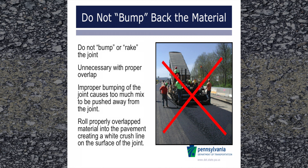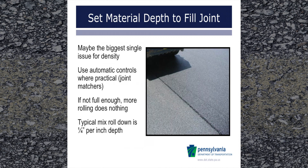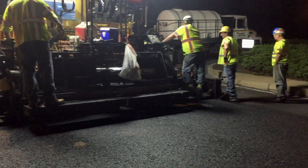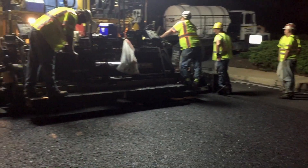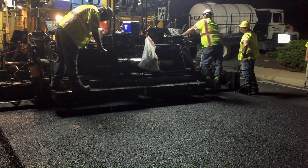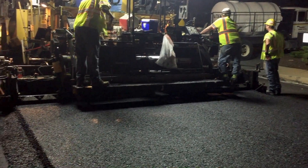When compacted, the material may have a thin white crush line. It is critical to make sure the second lane has sufficient depth of material to allow for full density during compaction. If the mix is not placed deep enough, once the roller makes a few passes over the joint, the weight of the roller will transfer to the first lane and the mix will not fully compact. The typical mix compacts a quarter inch for each inch of depth. So for a one and a half inch wearing course, the mix should typically be kept at least three-eighths of an inch higher than the adjacent lane prior to rolling. This can vary depending on the initial density coming out from under the paver screed.